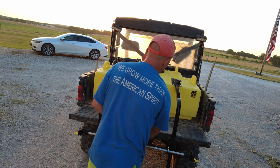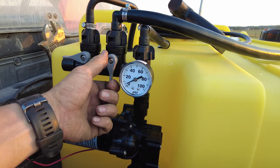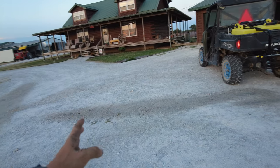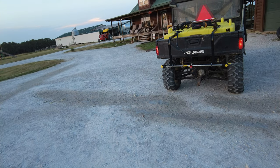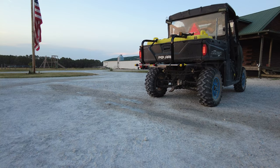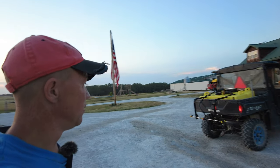We've got just a tickle over 15 gallons, which is fine. I have the pump on — it's probably working on being primed. There it goes. So there's our spray pattern. You can obviously see where it's hitting. It's got a good amount of overlap in the center, which is not a problem — I'd rather overlap some than miss strips. The center is a perfect mist, but the outside nozzles are set for a different pattern since they need to project out to the side.